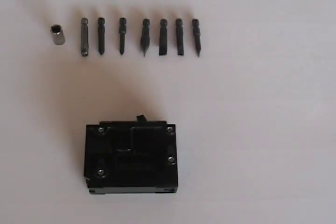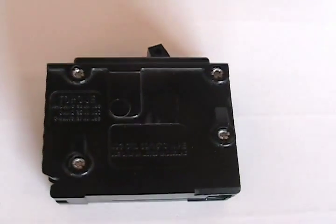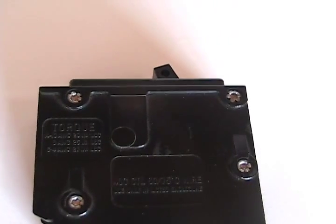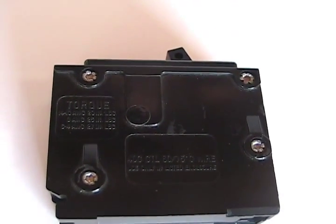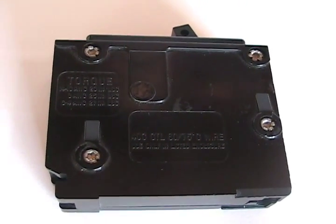When we come down to this circuit breaker, here's the point we're trying to stress. In the National Electric Code, it talks about in 110.3b, at the inch-pounds, things are to be torqued according to the manufacturer's instructions.